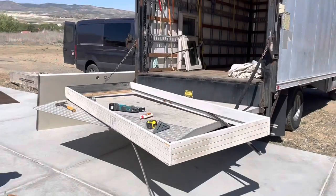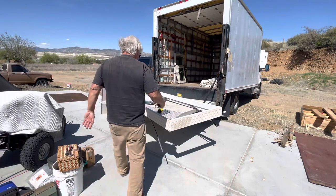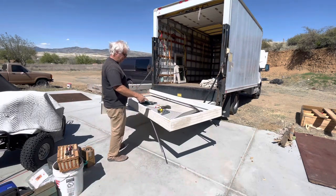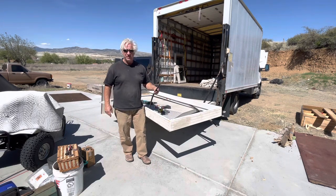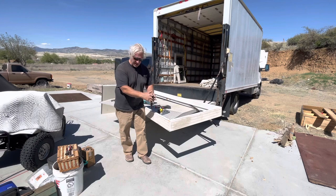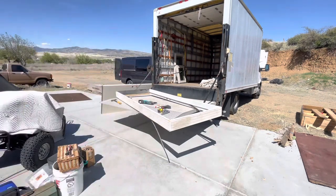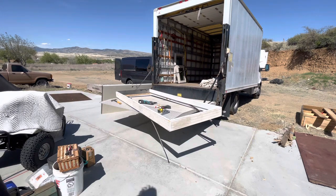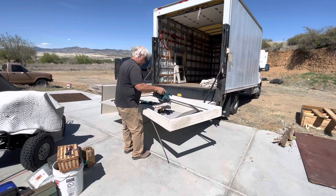All right, so here I'm gonna try to explain what I'm doing on the cut. I need 87 and a half, folks. I've took the door out and I've pulled the seals back. These seals go right back in. So when you cut them, they fit right back into the channel. That was a brilliant thing on these pre-hung, the type of seal they use. So what I'm gonna do is use my cordless.